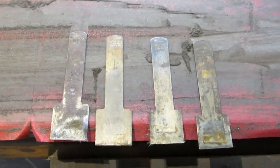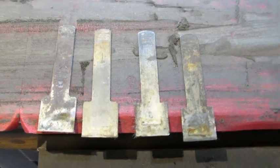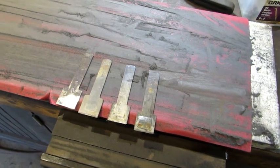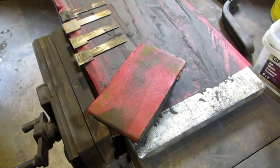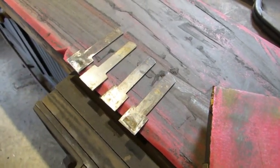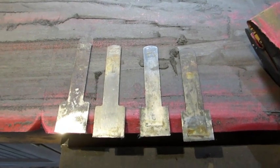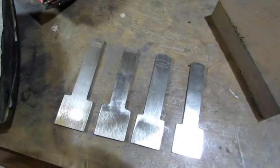While the painted parts dry and get repeated coats, I'm going to work on the irons. Tools for that: my lapping paper — four sheets of number 77, spray adhesive glues it down so you can pull them off and replace them — combined with sandpaper on my rubber sanding block for the initial cleaning. I always work with the original machine marks on the irons. The back sides aren't machined, so cleanup there will use a foam sanding block and steel wool.